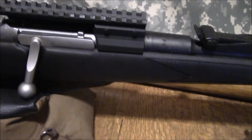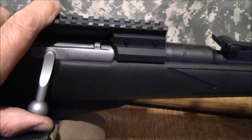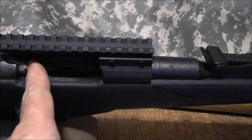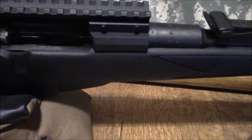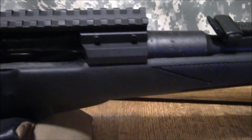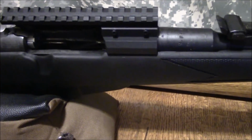One thing I do want to make clear to you is that none of the bolts that we used to install this, the 3 main screws, the 2 in the front and the one on the side, none of these protrude. They don't even come close to protruding inside the chamber. There's no screws to grind down. You still have plenty of thread engagement. The 262 Loctite will keep everything tight.